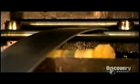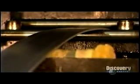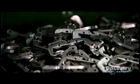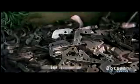Handcuffs start with a roll of steel. A machine pulls it through a straightener, and then through a die that punches out a handcuff frame part. A revolving barrel cage sifts out the waste and kicks the frames into a bin.